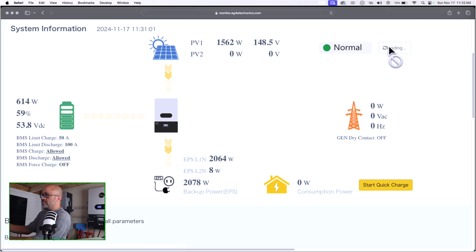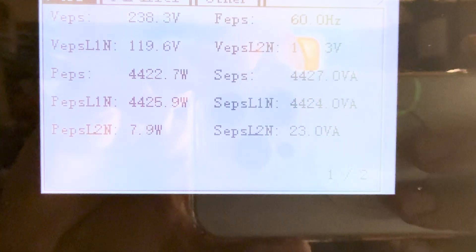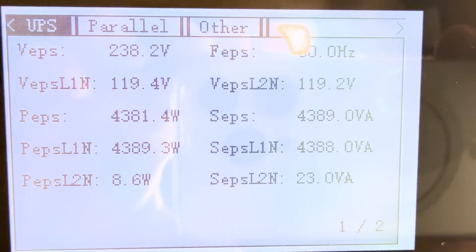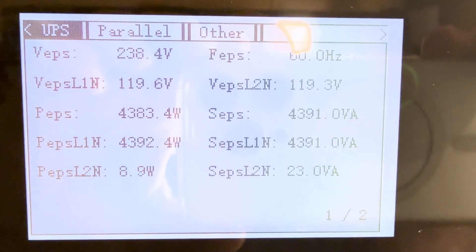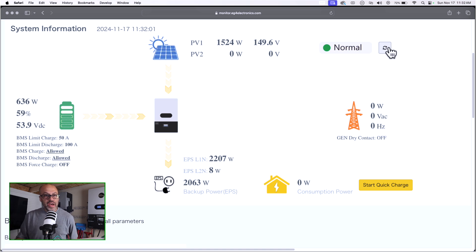I got the heater on — let me get back to the screen sharing. I'm going to go ahead and turn both the heat guns on. So as you see, we've got about a 4300 to 4400 watt imbalance, and of course the inverter is working fine with that. Let me get the screen sharing to update and show you — I did record it with my phone. Bam, there it is: leg one 4383 watts, leg two 7 watts. Not a bad leg imbalance.